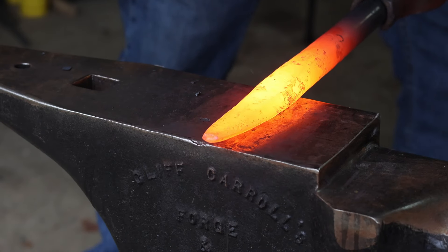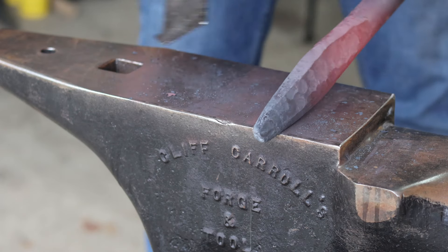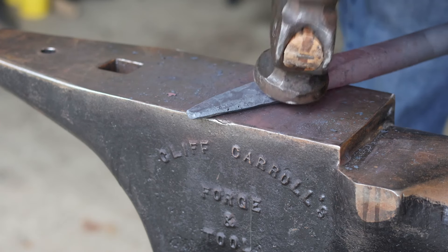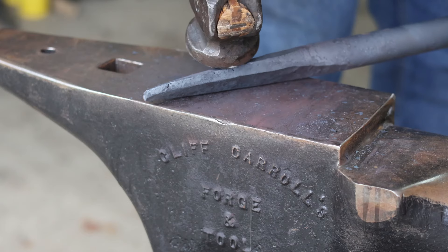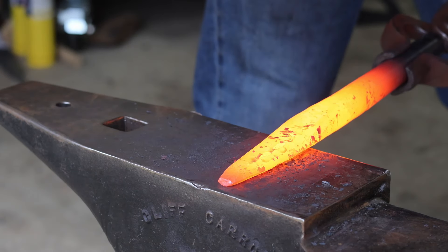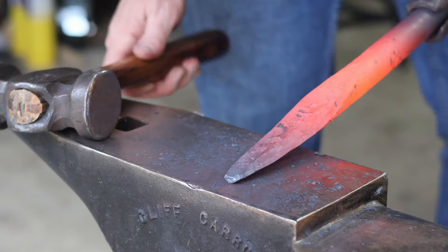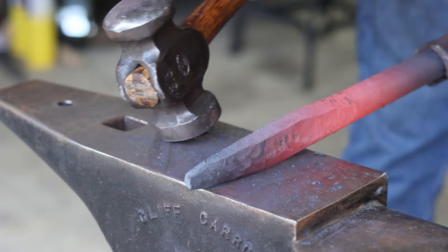That was close — I didn't realize I was that close to the edge. I've got a nice chip of concrete out of my floor to commemorate that. I'm sitting at about five eighths by just over one and a half inches at the widest point, and all in all that's going to be all right. The next heat I'm going to do is get a little bit more spreading by forging on what would normally be a bevel on a knife — forging down on this edge, this little facet, to blend that down to the edge and make that teardrop shape toward the edge. Notice that's picking up a bit of a curve now; that's how you generally forge in bevels on a knife. This will actually straighten out when I get to the next step.